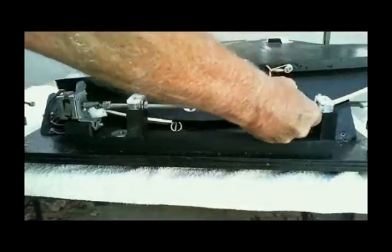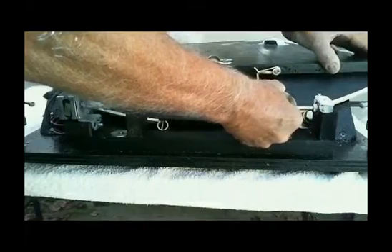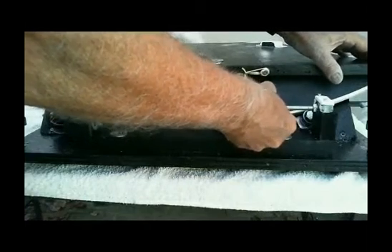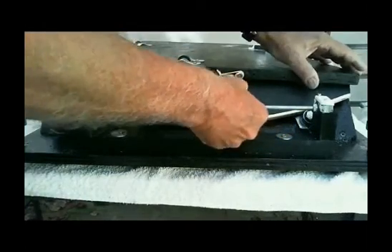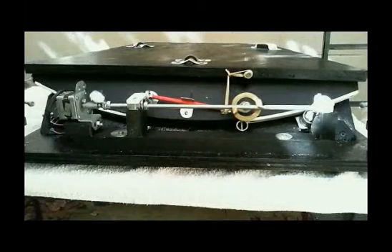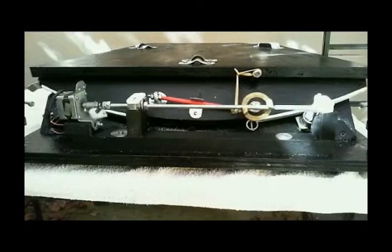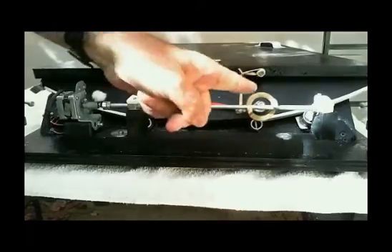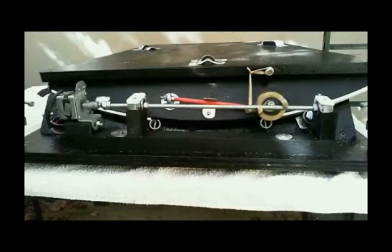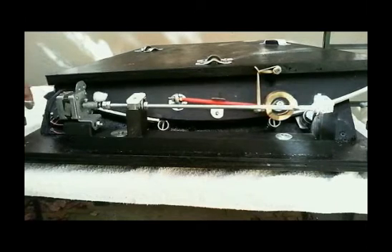Just putting more tension on the elastic band. This has been running, so as soon as we disengage the limiter switch, the motor starts going. Now you can see how it travels at high speed. Even at this speed, it can still move the telescope — the 14-inch Dobsonian — on it, because the balance is pretty good. There are the rod ends, which are used to give a certain degree of freedom, so that no tensions are built up during the change of angles of the nut and the threaded rod.